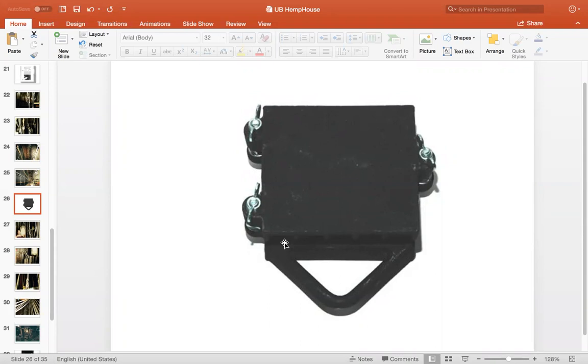This one appears to be, you can barely see it, but 1, 2, 3, 4, there's five, a five line clamp. So you run five lines through it and there are spring loaded fingers inside that clamp up against the rope, pushing the rope up against the side of this clamp. The springs were held in place by three bolts with wing nuts on them. If the springs weren't positioned properly, you could tighten down, but the clamp inside wouldn't tighten. People would not tighten these up enough. So it held for a little while, but basically the wing nut was loose and then it would just spin itself off and fall down. Right. And then the ropes would run. Or they take them apart and the springs fall out. Yeah. And you can't find them.